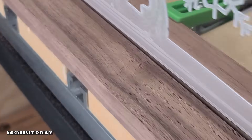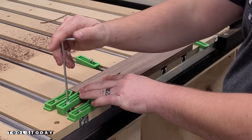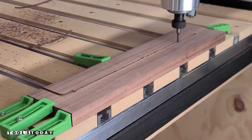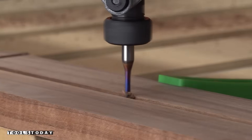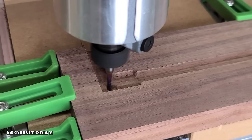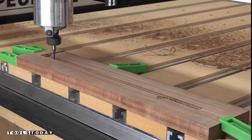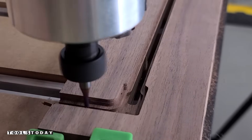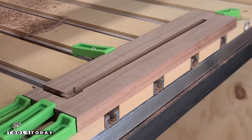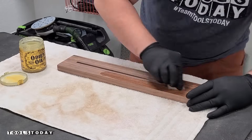Now that we got that done, we can get it unclamped and removed and flipped over to the opposite side after getting everything vacuumed off. We'll get that all clamped back down again and secured in place, and then we'll start our cutting on the back side. This is going to leave a channel for the lights to sit up into, as well as the power cord and everything else required for the LEDs. Going through in two passes to go a quarter inch deep through our three-quarter inch material, you can see a pocket opening up for where we have the lights cut. The lights are going to shine right up in there as the acrylic sits down into that slot — and it's going to work really well. So there are two sides: a slot on one side and then the opening for the lights on the other.